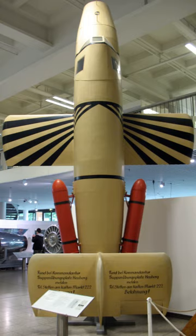By January 1945 Bachem was under pressure from the authorities in Berlin to carry out a manned flight by the end of February. On 25 February, M-22 was in the experimental launch tower. It was as complete an operational machine as possible with the Walter HWK 109-509A1 motor installed for the first time. A dummy pilot was in the cockpit. Lift-off from the tower was perfect. The engineers and ground crew watched as the M-22 ascended under the combined power of the four Schmidding boosters and the Walter motor, an estimated total thrust of 6,500 kg. The nose separated as programmed and the dummy pilot descended safely under its personal parachute. The remainder of the fuselage came down under its two large salvage parachutes, but when it hit the ground the Walter liquid propellant rocket motor's residual hypergolic propellants exploded and the machine was destroyed.